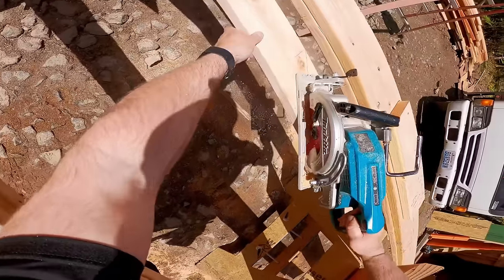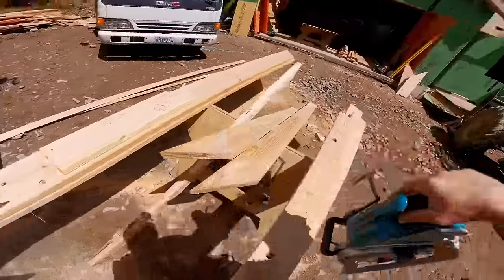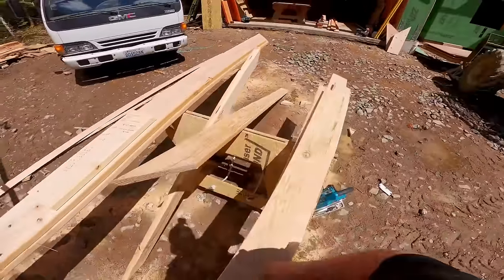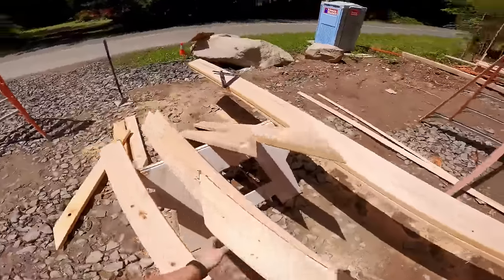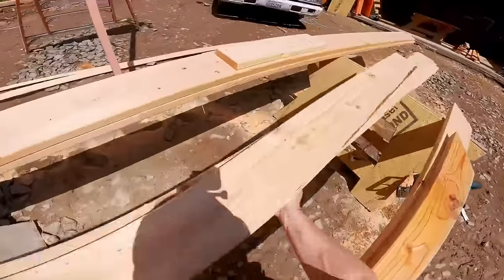When I have to cut a bunch of overframe jacks, I like to put as many 2x6s on the saw, or whatever the stock is, on the sawhorses, crowned away from me. All plumb cuts go on the right. That way, when I pull a number, it's to the sharp, to sharp, to sharp. That's what we always call it. So it is the long point of your seat cut, which is also the long point of your bevel cut.